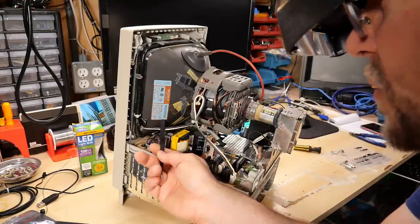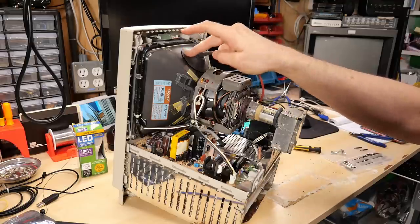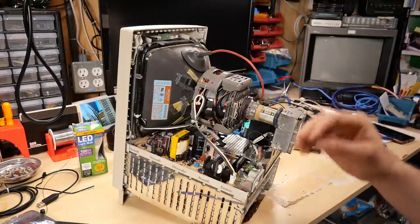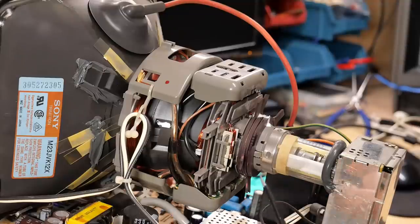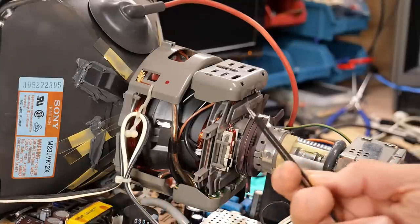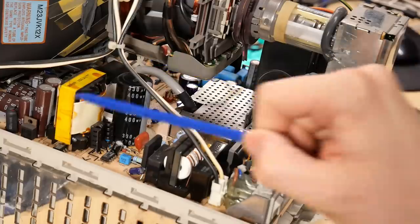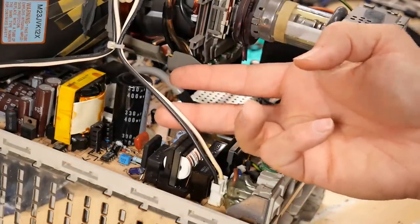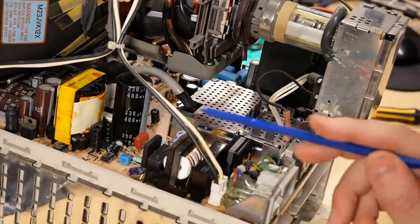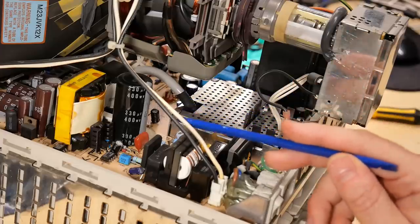Here's the Sony Trinitron tube — it's an M23JVK12X, that's the part number. Made in Japan, of course. I'm seeing very little dust, very little soot on everything — it looks pretty good. I don't think this thing was used very much, or it was used in a very clean environment, although judging by the dead bugs, I'm not so sure about that. It's always interesting to look at the deflection assembly on Sony monitors — there's just look at all these little coils all around, there's some adjustments up at the top, and to have nice geometry required for a computer monitor you need a good amount of adjustments, and there's a lot of advanced stuff going on here. The mains inputs come in right here, and this whole section is the switch mode power supply that's running not only the monitor but also the main computer components. This white and black wire is going to the degauss on the monitor, and there is a PTC right here handling that. The original Macintosh doesn't even have degauss — you don't really need it for black-and-white screens because you're not going to get color distortion from magnetic fields like you do on a color screen.